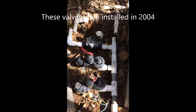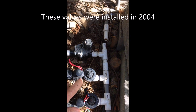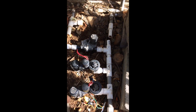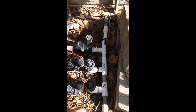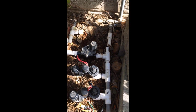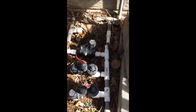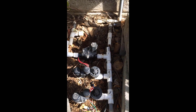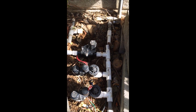What I've got here is my sprinkler system. I have zone one, two, and three, and number three is plugged up — it's not working. It'll come on but it won't shut off. So what I've decided to do is replace all three of them with newer seals and diaphragms, that way there's less chance of having to repair the next one next time.